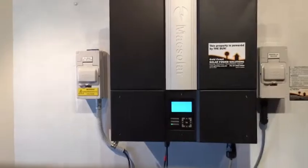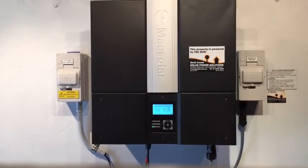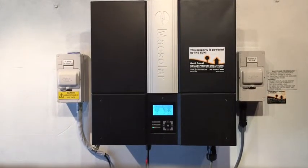It takes about a minute or so for a solar power system to actually start up. At the moment it's just got the power light on — we want to see both the power and run light on for this system to be working. If just the power light is on but the run light is not on, then the system is not working.